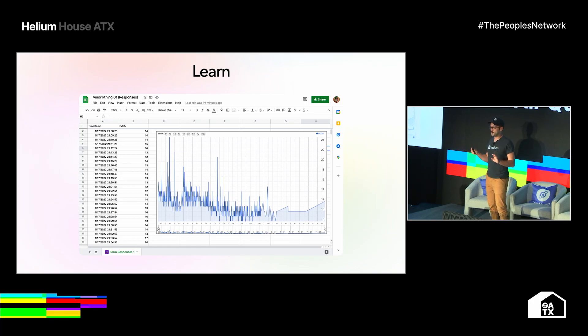And then that's it — you've glued the two things together, you've pasted the two code things together, the project is done. This thing is onboarded in console, and the next step is to start playing with that data. The favorite way I like to do this with any new sensor is to start dumping things into Google Sheets. Google Sheets is an integration that is in the Helium console, and as long as you can put the decoder in there — which is all in the GitHub — you can start to visualize and understand what these metrics mean. Even though we're seeing some noisy data here, it's super fascinating that I can see the difference between daytime and nighttime in the city I live in.